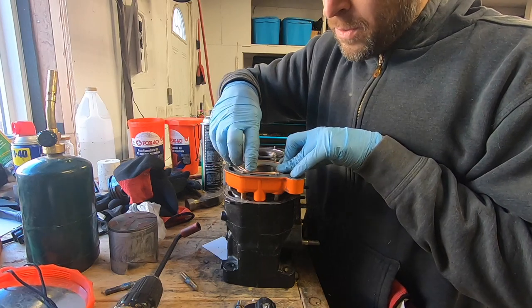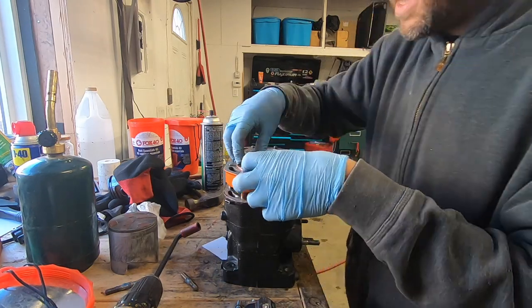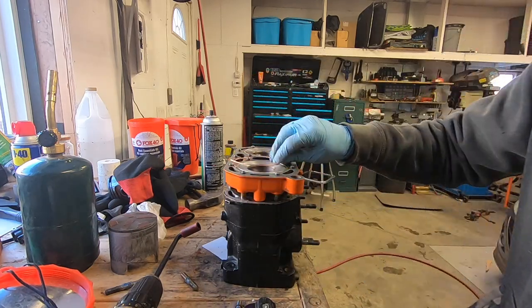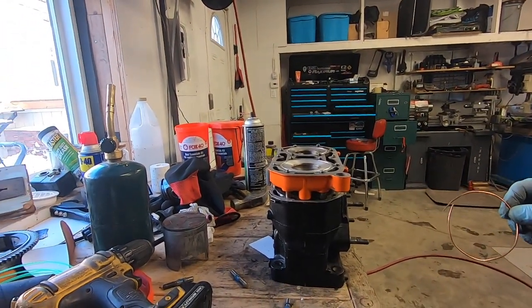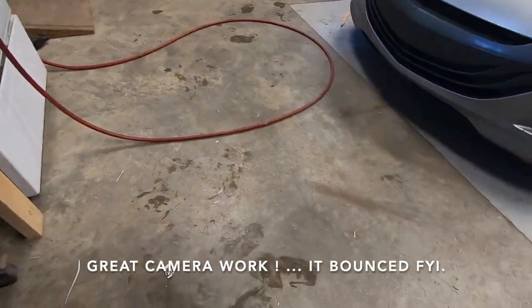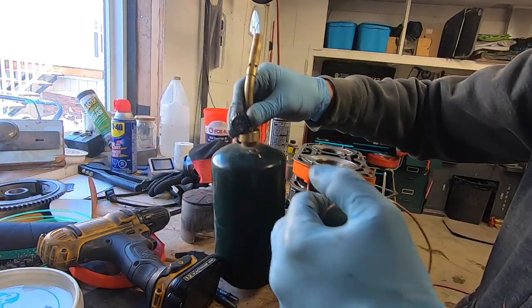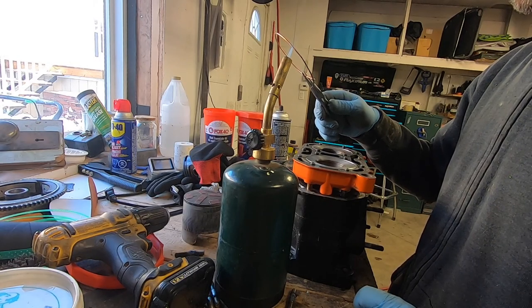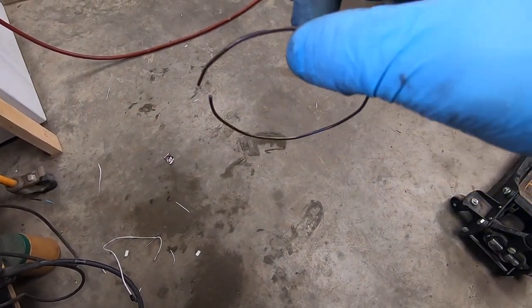So now I have a piece of copper cut out that can be my seal. It's a bit too long and it's not the right shape. As you guys can see, it's kind of springy and doesn't like to cooperate, so what you need to do is anneal it. If I take this piece of unannealed copper and drop it on the floor, not a whole lot happens — it kind of bounces. I'm now going to anneal this with the torch and then drop it on the floor again and show you guys what happens.